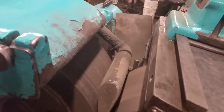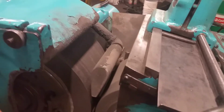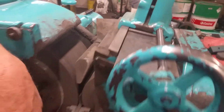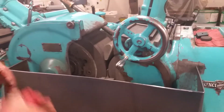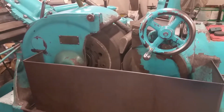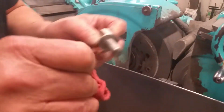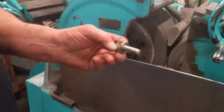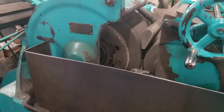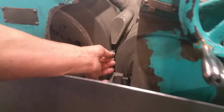Right. And how does your work come in there across the bar? With this machine, I'm set up for what they call infeed grinding. In other words, parts with a head on it, but you need to grind the shank. So the part does not go through the machine. It sits right here in one place.